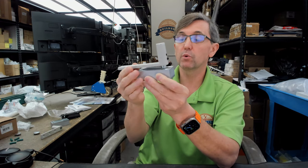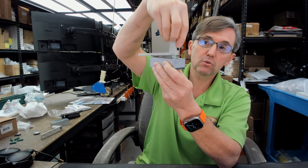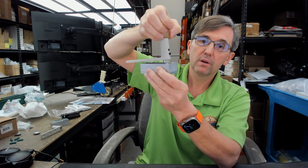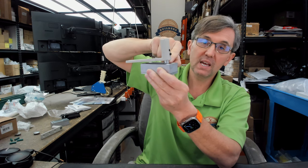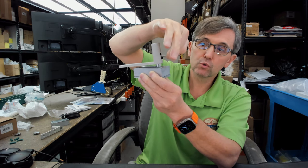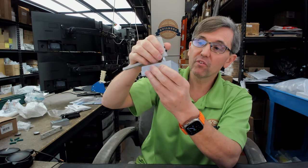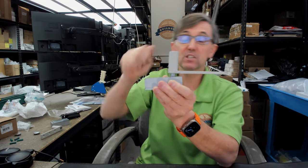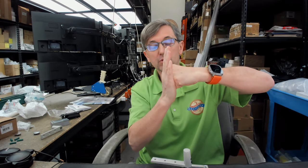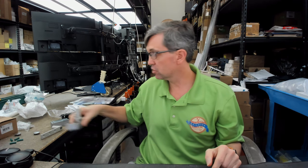Well, let's say you need 5/8. You're going to get a door lifter underneath there and lift that up. What you're really going to do is these set screws will be loose, the casting will come up from the pin, and you'll tighten that. Except you'll remove one of them. You'll drill, I think it's 3/16, a 3/16 hole about 1/8 of an inch deep into the pin itself, and then tighten the set screw again. And that's what's going to lock it in place, not just set screws against that pin trying to carry the weight of a door. So you're going to have to modify these pins to get that set screw to sit inside of there a little bit. And that's actually how that works.